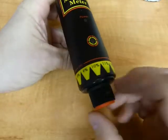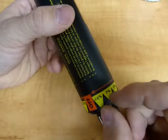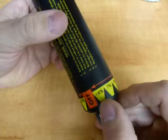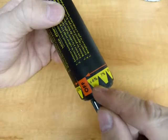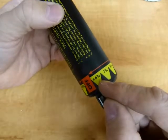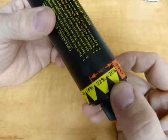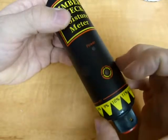The other part of the circuit is connected to this selector knob, and there is a series of electrical resistors here that correspond to the 6%, 7%, and whatever settings on this instrument. The highest resistance corresponds to the lowest moisture content, because the lowest moisture content is conducting the least amount of electricity — that's why there is the highest resistor here. And then a little lower resistor, a little lower, and on this side where the highest moisture content is being determined, that's where the resistor with the lowest resistance is found.